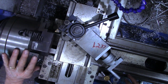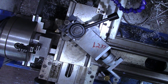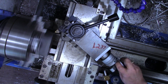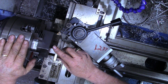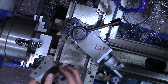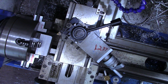As you can see, we're taking these corners off at each location. The original did that until the edge blended with the outside edges. I'll see how far it takes to clean those corners up. I'm going to realign the way the tool is addressing the work to get a little straighter. We're getting much closer to being rounded right at the outside edges, but we're not quite there yet, so we'll take a few more cuts.